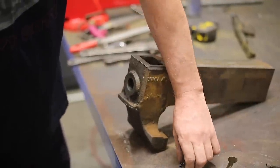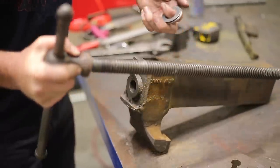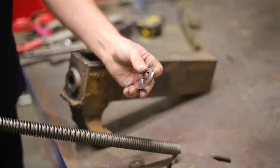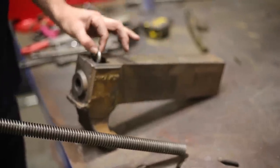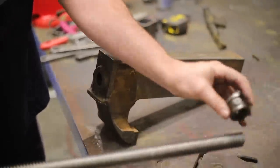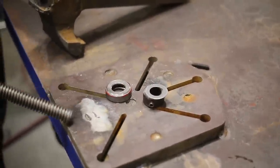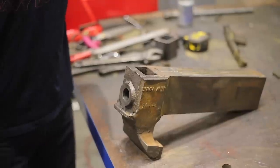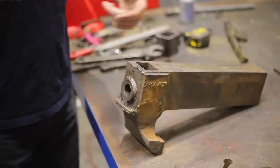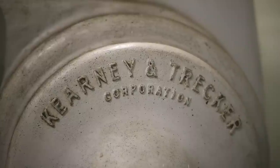And then on the back side, because like I said, we want to have it smooth when we release the pressure too, we're going to put these real thin thrust washers, thrust bearings, on the inside. And this is the nut that goes over the top, and this is what pushes it backwards. That will go inside of this little pocket inside here. So we need to take it to the milling machine first, carve ourselves a hole, and then we'll assemble it all.